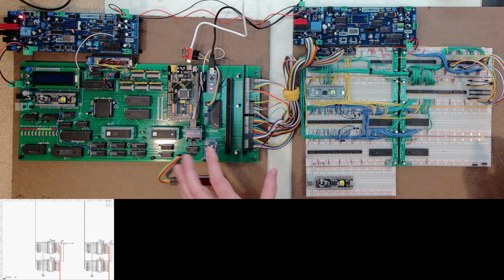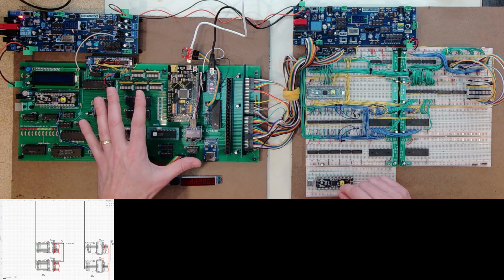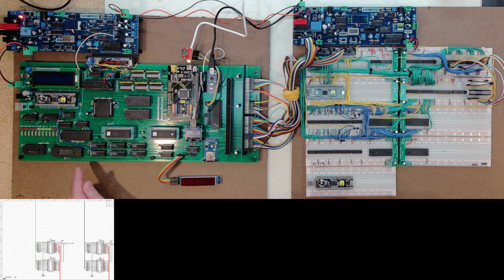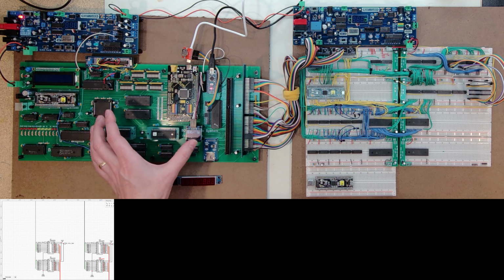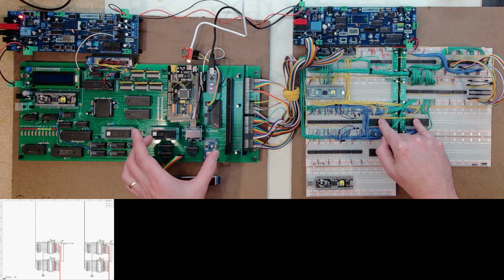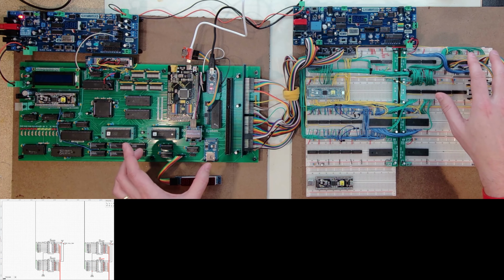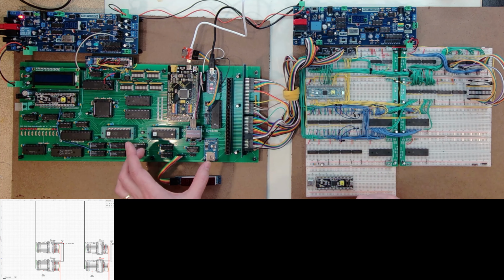So a couple things I'll point out over here. Really, this has not been touched on the 286 side other than a couple of things. Again, this resistor, I changed the value of it. And I also did put back in the routines to test: I'm testing RAM on boot, I'm testing the first 64K of VRAM, and then I added a test to actually test the register over here. Can I write a value to the register of the VGA circuit and read it back?